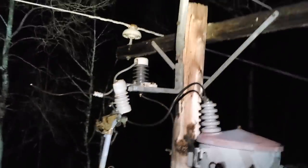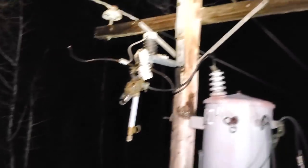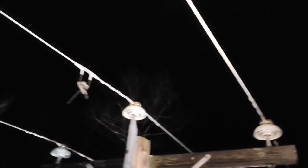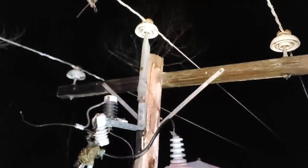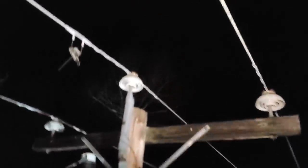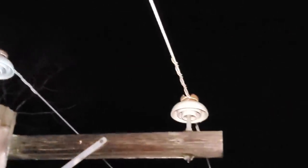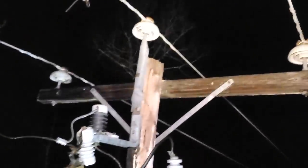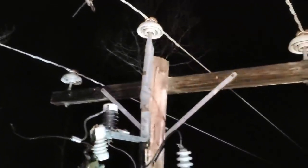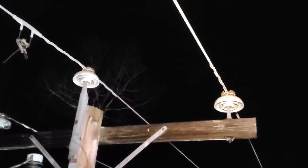There's not too many of these porcelain guys left out in the field. So up over my head here, we've got 12,470 volts, 7,200 volts phase to ground. Now one of the first steps when you approach a pole, regardless of what you're doing, check your ties. You see at the top, these are preform steel ties. Sometimes they break — maybe a tree came down mid-span a while back and breaks the ties, maybe it's just old. Either way, you get working on this pole and one of those ties are broken, you can be in a mess.